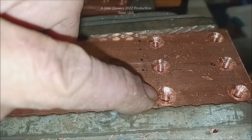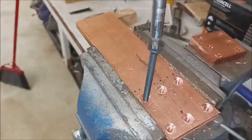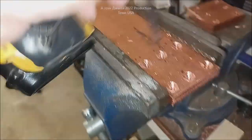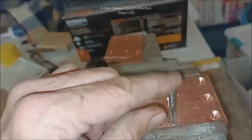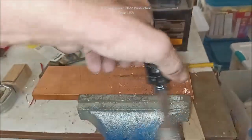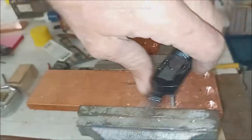I've done that one, and we're going to do this one where I've just started it. I use the previous bolt - just take it and shoot it in about a thread and a half just to kind of clean the top. Using a regular impact, make sure it's nice and squared in, and then it threads in - back it out. Now I can take the tap set and run it in here and clean it out. You can see the tap still wants to grab some more because those bolts - they're not made perfectly. I'll run that in - quarter-20 - and you can see a little bit of filings coming out, and I'll run that in to get it nice and clean.